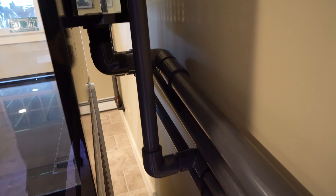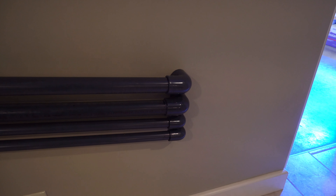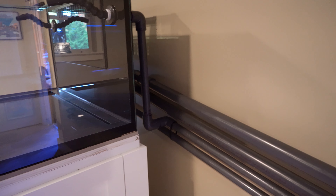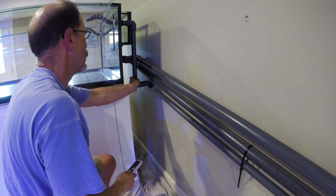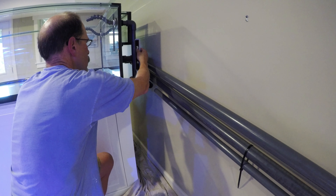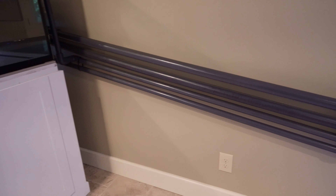As you can see, I've got a number of 90 degree elbows in here. For the proper pitch on this PVC piping, those elbows have to be at the right angle. So you have to be patient and measure like three different times. I also use a level when I want to make sure that something's leveled out. I started on the top and worked my way down. The two drains on the top are one and one half inch drain pipes, and the two return lines below are one inch PVC pipes.